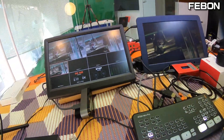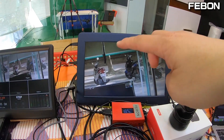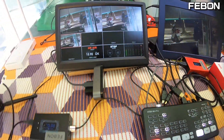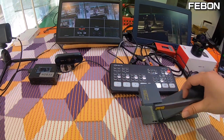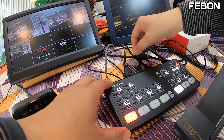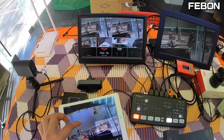After you see the information on screen, plug the HDMI cable into your ATEM Mini Pro — connect to HDMI input 1. The video will display on the multiview. You also have a clean HDMI PGM mode — I will show how to do that. Channel one is the Memostar camera, and you can use your iPad to control its ePTZ.